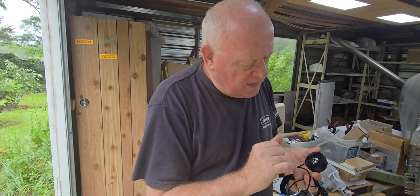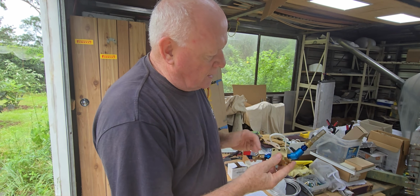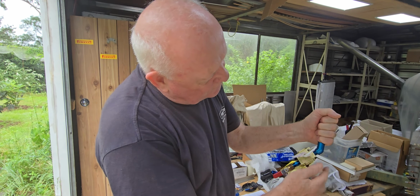So there's these two little guys to go in. I've got the fuel system. This is basically pretty much mirrored to what Sonex have shown us on the drawing. So from the underside of the fuel tank, through a bend, through the fuel flow, through a fuel shutoff, another angle, and then straight out through the firewall through another AN fitting.